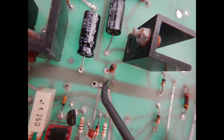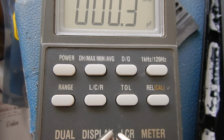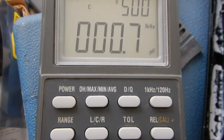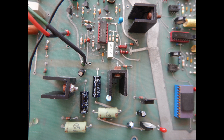I've also checked again all the capacitors on the monitor PCB and found more shorted tantalums, like this one, that has a black spot on its side. This one instead turned almost to an open circuit. This one too went open circuit. So, even on the monitor PCB, I've replaced the 35 volts tantalum capacitors with aluminium electrolytics rated for 50 volts